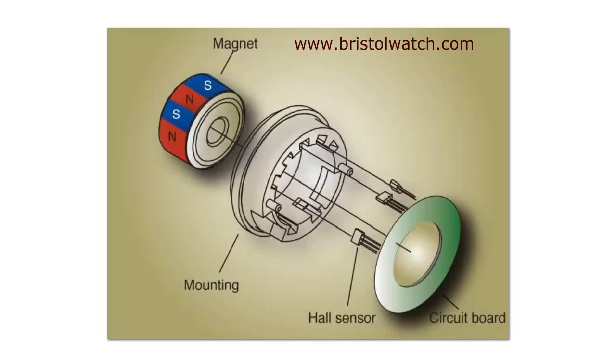Let's look at how Hall latches are used in brushless motors. Here are three Hall sensors on a circuit board. The stator has coils of wire that are switched on and off by electronic switching circuits. The rotor has alternating north-south poles, and as it rotates the south pole on the face turns on the Hall sensor — giving a low output — and when the north pole comes up it switches it back off, creating a square wave output. These three sensors are offset so the electronics can determine motor speed and position.